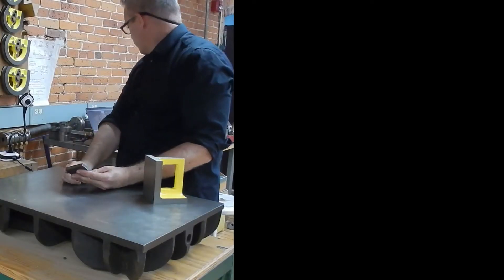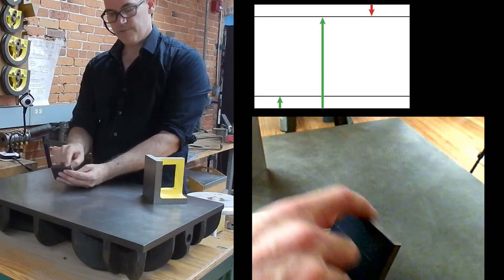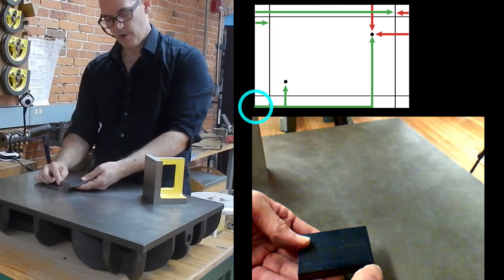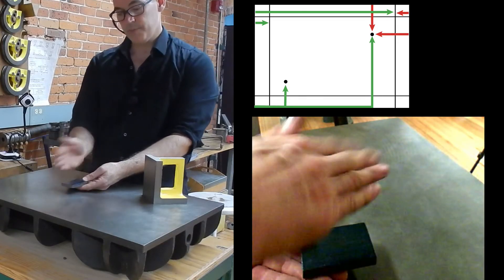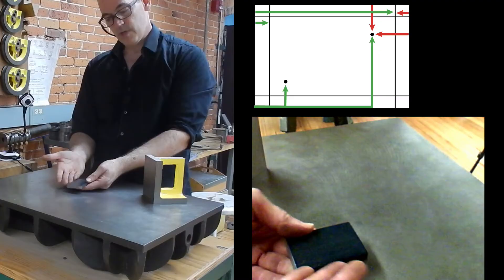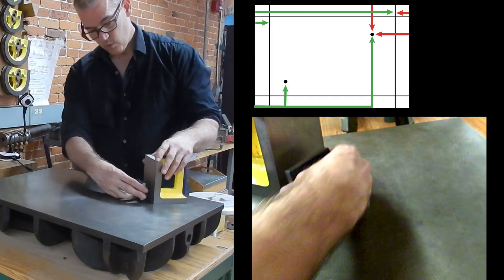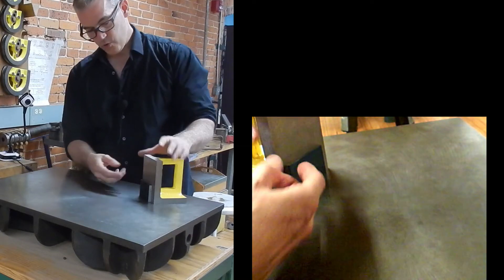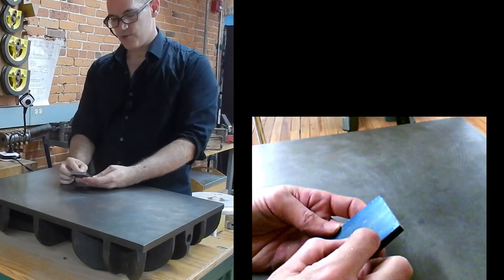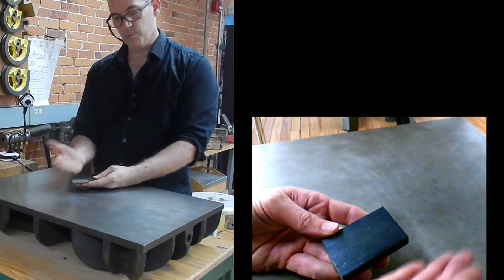Think for a minute about your reference surface. If I measure everything from one side, it doesn't really matter if my edges are off a little bit. If every measurement comes from one reference point, I will have accurate interior measurements. If I measure some things in from one side and some from the other, it's pretty guaranteed that they'll be off. So one of the things you'll want to do is make sure you're always measuring from the same edge — mark your corner and your edge. Any mistake you make in measuring will be magnified each time you rely on that mistake for accuracy. Measuring from a reference point or reference edge will remove as much of that as possible.